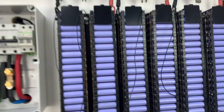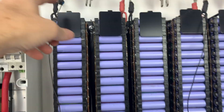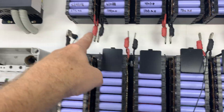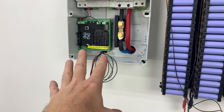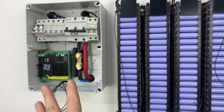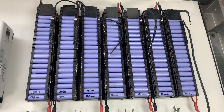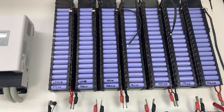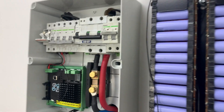We've got to hook up the balance leads — going to fuse all of these, put little glass fuses on, heat shrink it, and then put a little ring terminal on so we can hook it up. Then we've got to put balance leads between each pack, wire the BMS, and then we can turn it all on, which will be a little bit exciting. Thanks for sticking with me for the last three videos — give us a like, rate, subscribe, and I'll see you on the next one.